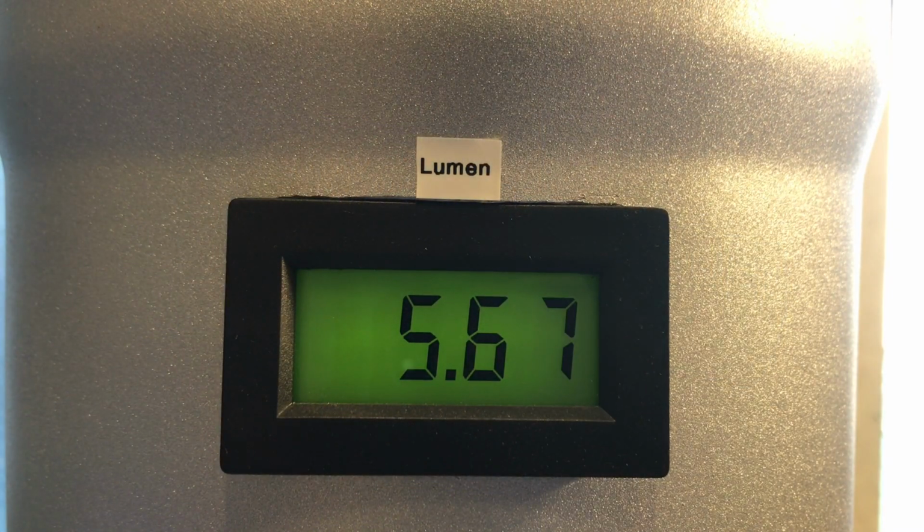So guys, here we are at the Ulbricht ball on the eco mode, which should have 8 lumens. Here I measure around 5.8 lumens. So I told you that I thought it would be a bit less than 8 lumens, and it's a fact. In this mode the light draws 0.01 amp.